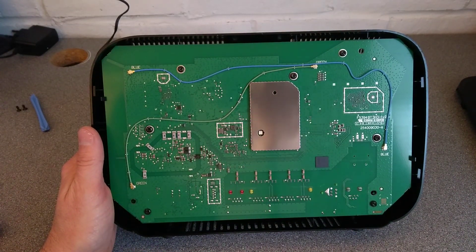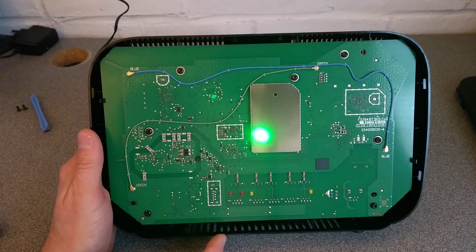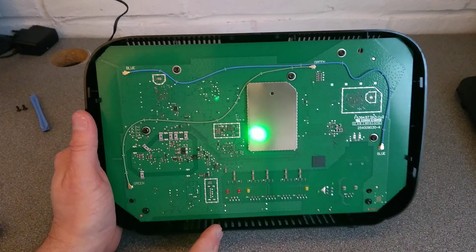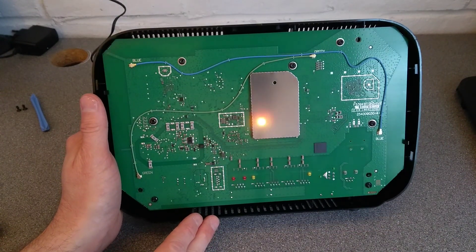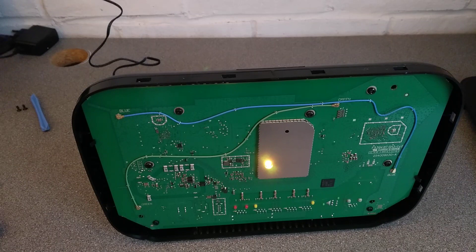I can see a persistent image of that LED in my vision after looking away, and you can kind of see on the camera that it's causing a corona-type effect. That's a bright LED. This will go blue when it's connected correctly, and blue LEDs are pretty good at burning out. So if they're running the LEDs at high power, I wouldn't be surprised that in three years or so the blue LEDs become much dimmer or entirely invisible — which used to happen to a lot of the UniFi or Ubiquiti Wi-Fi points in their original design as well. Very bright multicolour LED.